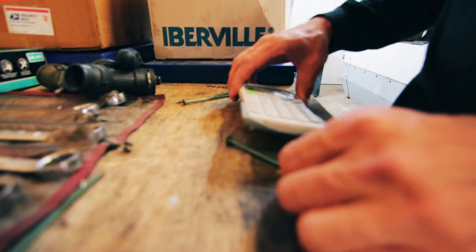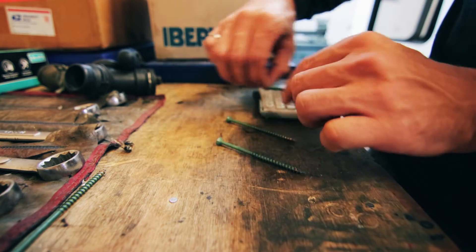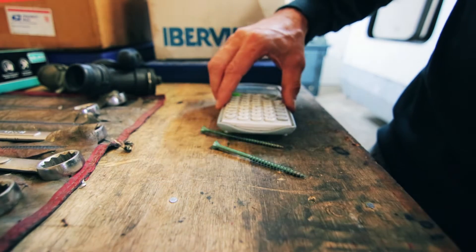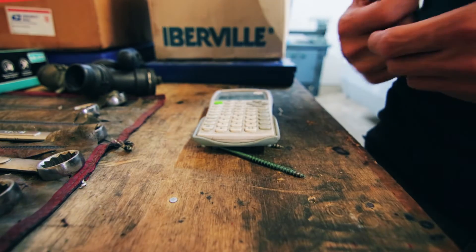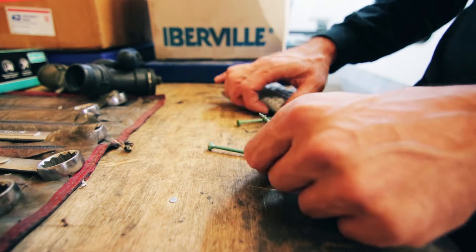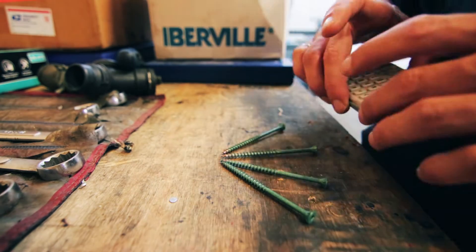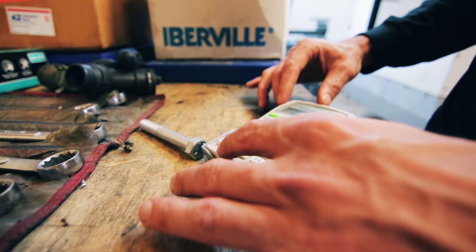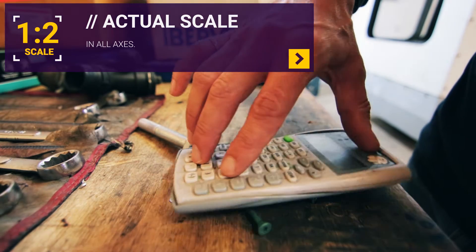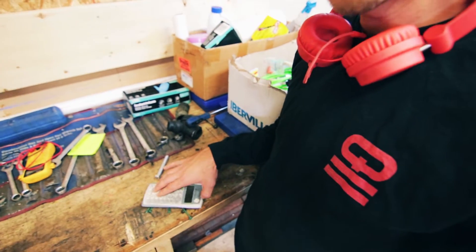To bring it in, what we did was we put the chains kind of across like this, so as it rolled in it would move sideways, which worked really good for avoiding smashing the lathe. And to get it to roll around a corner, if you do something like that, it should swing like that — feels right on the screws. It's swinging around pretty good, so this little plan here I think should work. It totally spins around there though.